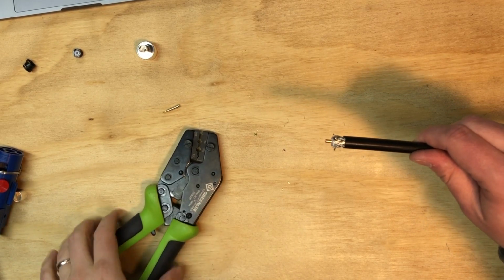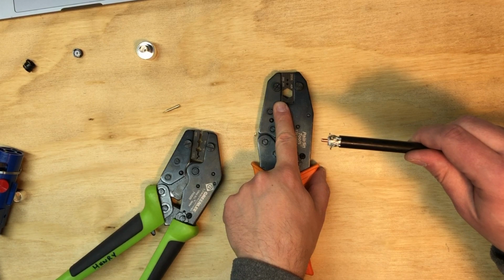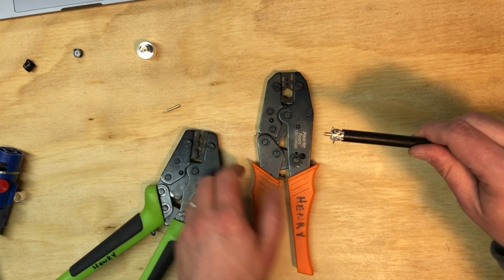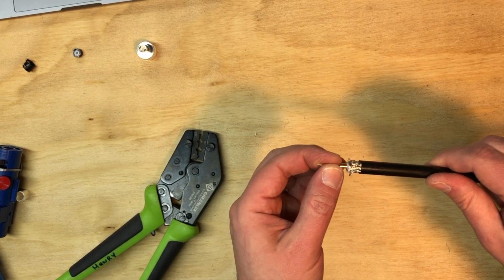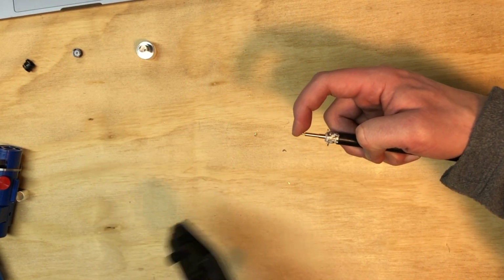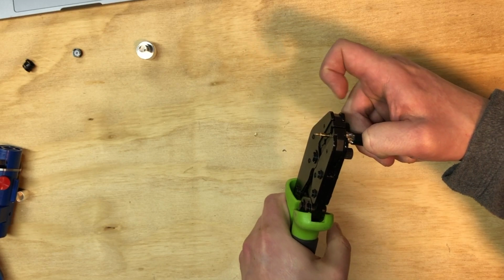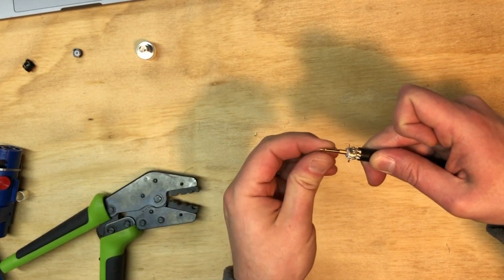All right. I supplied you with a crimper set that has both a .429 for doing the outer ferrule, and it also has a .128. The set of crimpers I have has a .100 in it, so that's too small for doing this center pin. So I'm going to have to switch crimpers here, but the set that you have has everything you need all in one die. So I'm going to put that on, and I hold it on there with my finger, which kind of hurts, and then I put it in there all the way. All right. Oof, wow. That's perfect. Okay.